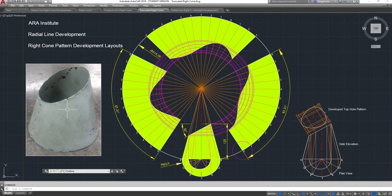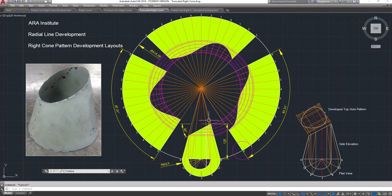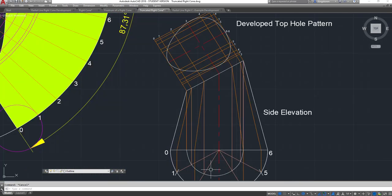The next one is the truncated cone - I've got a zintec one and an electro-galvanized sheet one that a student made. The side elevation is the portion lit up in blue and the plan view is the piece on the bottom. Because it's cut on a 30-degree angle, when we look down on it we don't see a true circle - a true circle would only be there if it went horizontally across. So we have to develop out that pattern, and you can see the actual profile of the hole is clearly not a circle - it's been elongated one way.